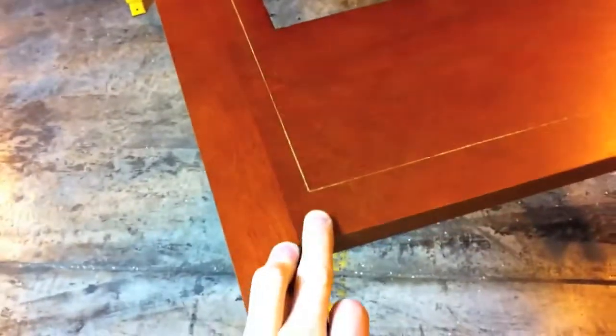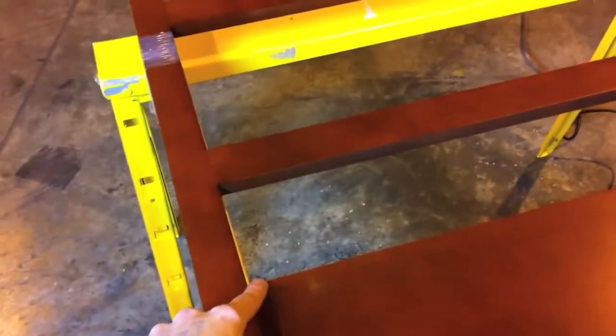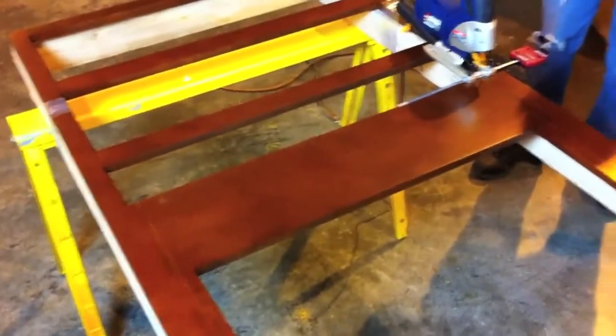We built a little 2x4 frame behind it. You can see it makes it a little easier to cut — put it on a sawhorse and then we score the line for our double oven configuration. You can see it comes down and we're going to eliminate the top of three drawers so the oven will come down to this point. That whole rail here and this little bit of material on the side and up to here is going to get removed, and that'll give us the rough opening we need for the oven itself.